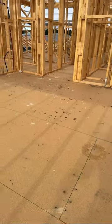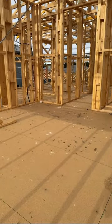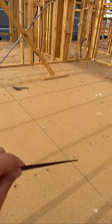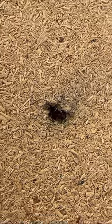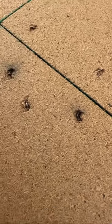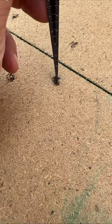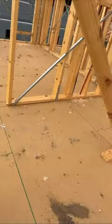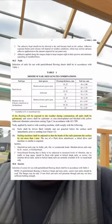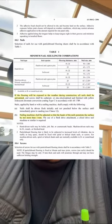Because this frame is exposed to the weather, the nails fixed to the floors must be galvanized. They're not galvanized at all — you can see they're already rusting. Also, when using a nail gun, the nail cannot penetrate the surface more than 1mm. Here we have about 5mm in one spot and about 3mm in another, and that's common throughout the whole area. The Australian Standards are clear on this requirement.